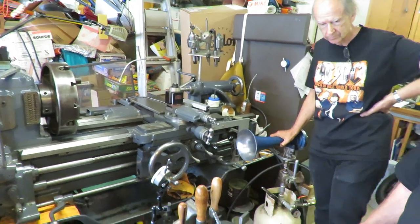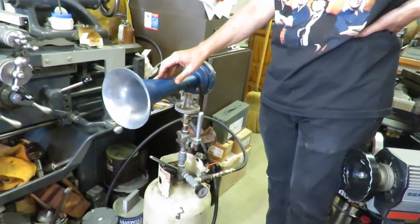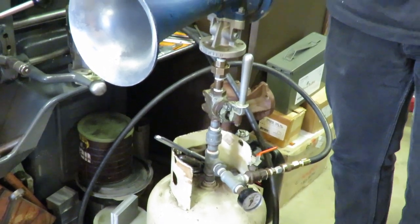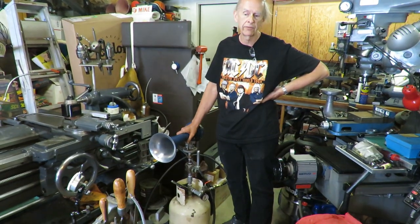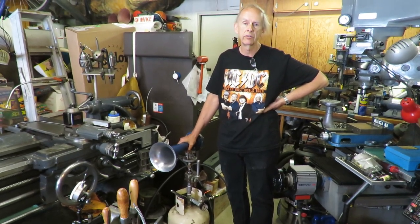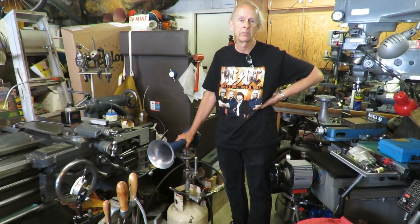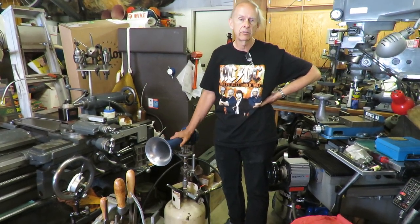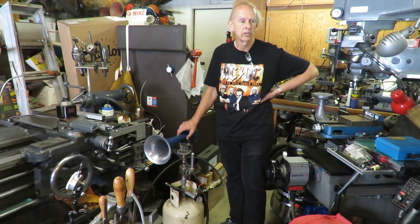Down here is a bit of a test bench. This is a surge tank off my main compressor, and it's what I use when I'm tuning a horn bell to a particular note. I'll go back and forth between the milling machine — pocketing it out to lower the pitch — then put it on this test stand, blow the horn, and use either tuning software on my cell phone or a guitar tuner to measure the actual fundamental frequency the horn is blowing. A lot of customers want their horns tuned to the actual advertised chords, but production horns never actually blew the advertised chords — they're always off in pitch.